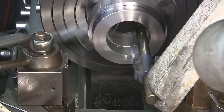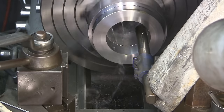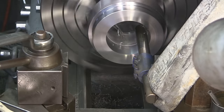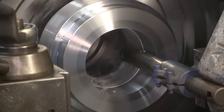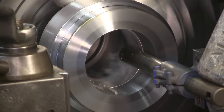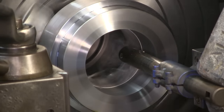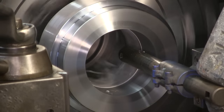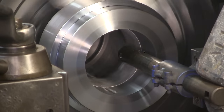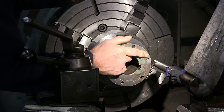Most of the time you're boring out from a smaller size to larger, where somebody has the perfect pitch and blade combination that will run good on their boat but the bore is undersized for their shaft. I can bore and key a shaft and swing up to 29 inch in the gap — that's what these bars have been designed for. We're going to take a couple of passes and bring you in when we get to the diameter where we're really concerned about improving our finish.